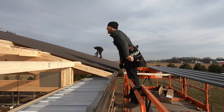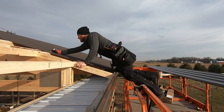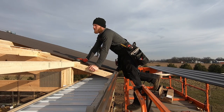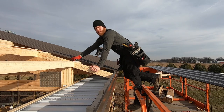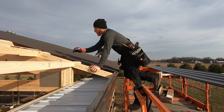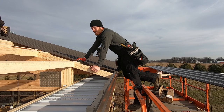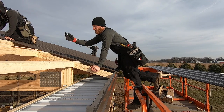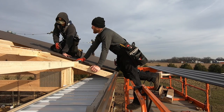The nice thing is by using 18-foot lumber, we almost always have a nice change on a sheet. What that means is we're going to be able to mark the edge of sheet with an arrow pointing back so we know which purlin is what, and an arrow pointing forward. It's just a little thing we do and it works out quite well. It's not to say that a guy doesn't miss one once in a while — all you've got to do is fasten a block and extend your purlin, fasten another block so that you hit some solid wood. One screw miss is not what anybody wants, but it happens because we're human.